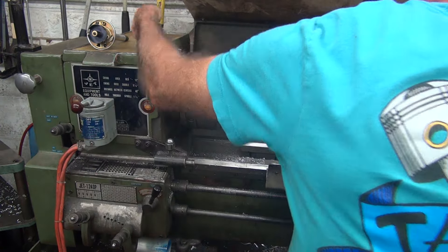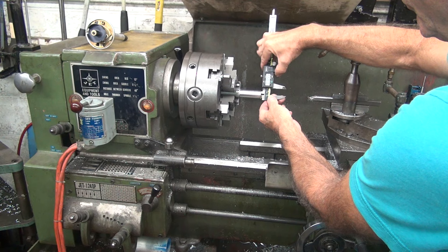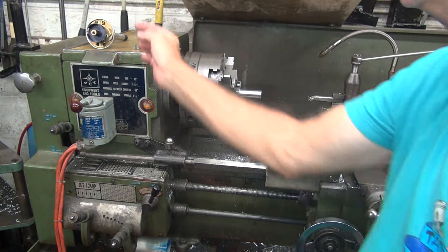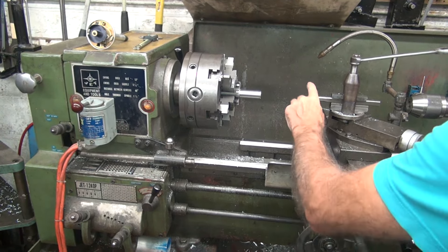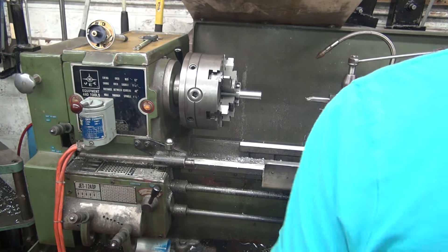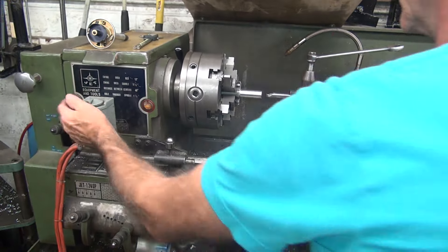We're going to drop out of the hole so you can measure it — clean off your caliper. Seven oh seven and a half right there, we need two more thou. So we were four and a half, cut two, and we cut three — they cut different. I'm coming out sometimes, it actually cut a little bit more than I was supposed to. Okay, we're starting to cut another two, so we'll try two. I don't want a perfect fit — got a little bit of the slip, so 10–11 is probably okay.